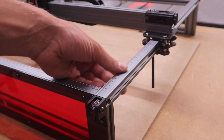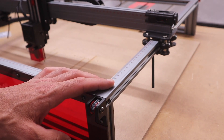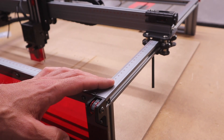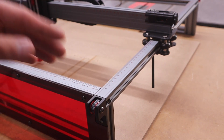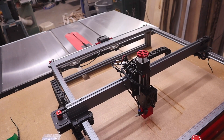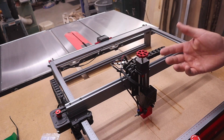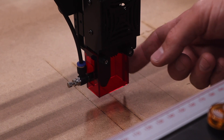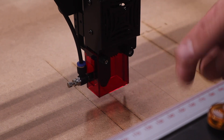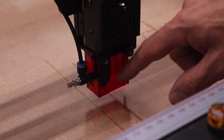Another feature I really like is how the timing belts are all fed through the extruded aluminum frame, so they're protected and can't get dirty or gummed up. I leave my laser engravers in my dusty shop and they get pretty dirty - if they get dirty it throws everything off and you don't get a good engraving. I also really like the cable management system - everything runs through drag chains so there are no loose cables to get tangled up. There's also a protective shield that goes all the way around the laser to protect your eyes.